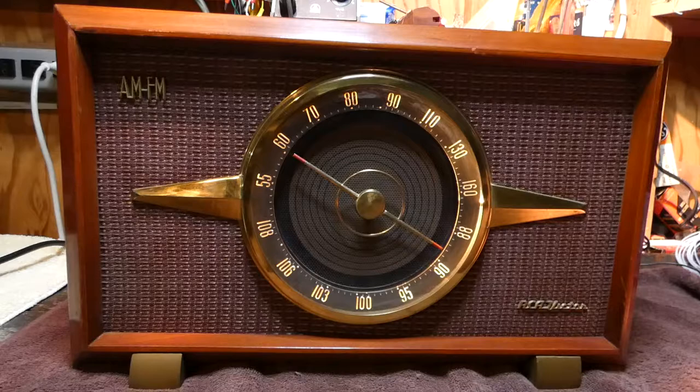So let me explain what happened. The radio looked like it was in good shape — the plug wire wasn't broken or any issues that might cause a safety concern. So I put the radio on the bench, put it on my Variac, and slowly started bringing it up. I started to hear some static; I got it as high as about 80, 85 volts and there just seemed to be nobody home. So what I did was I went to the miniature tubes and just grabbed the very top of each one to give it a little better contact. When I did one of the miniature tubes, the radio woke up and actually played pretty good.